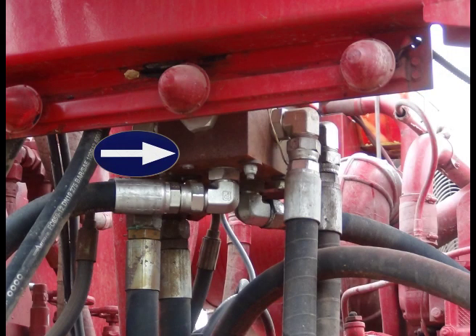Here's an electric diverter valve that diverts the oil from fast top head feed to lower rotary drive. You're never running the lower rotary drive at the same time you're tripping out of the hole, so it works very good. It's number 16 JIC, 24 volt.